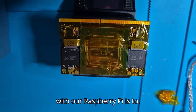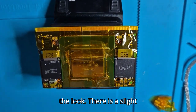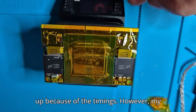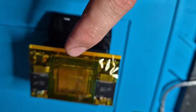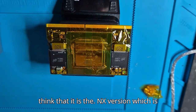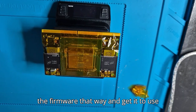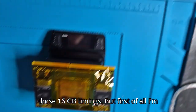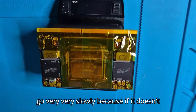The plan, as we did with the Raspberry Pi, is to install the new RAM chips. There's a slight possibility the firmware will lock up because of the timings. However, my plan is if that's the case, to either spoof the board and get it to think it's the NX 16 gigabyte version, see if we can flash the firmware that way, and get it to use those 16 gigabyte timings. First I'm just going to replace both RAM chips. This is a very expensive thing so I'll go very slowly.